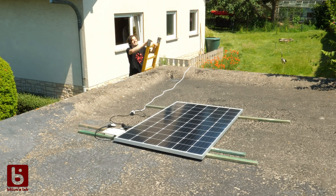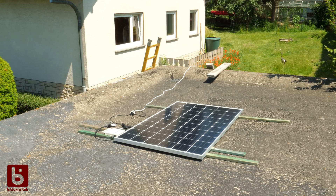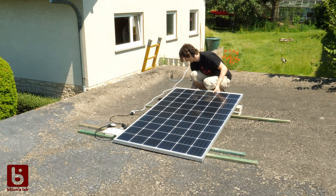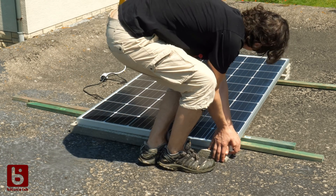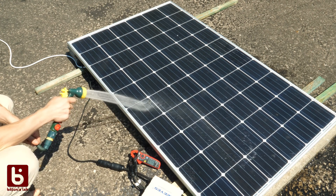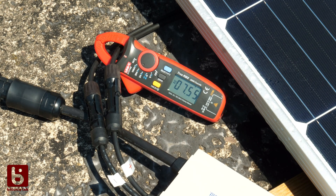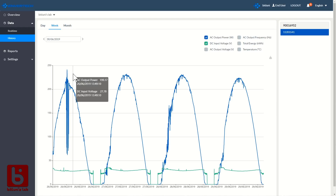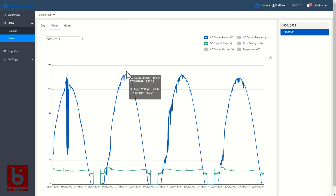On the monitoring side we can also see the panel voltage which seems to be optimal at 30 volts. Let's check around 1 o'clock again. Even in midsummer the sun isn't straight up, so I'll give it a slight tilt. We get 7.6 amps — that's 230 watts. It's really hot outside so I think the efficiency of the panel is lowered. Putting water on the panel rather lowers the current at first, but checking the statistics it gives a bump of around 10%. So the hottest days are not necessarily the best for solar. This was the hottest June day ever recorded, yet I got more power the day after without changing the setup.